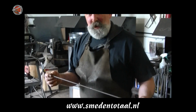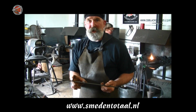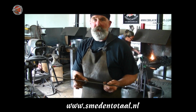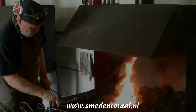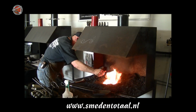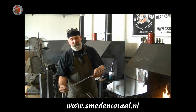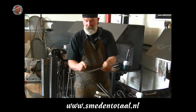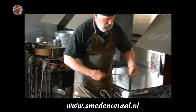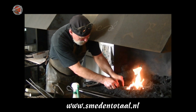So I take the 2 bars, I mark center. I'm going to need a heat that's at least 2 inches on either side of this to wrap it on the bick. I mark these bars in the center. We need about this much heat to be able to wrap it on the pin. They lay them across the fire. Hopefully you got enough.